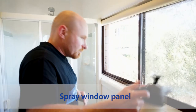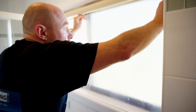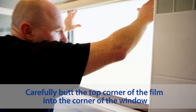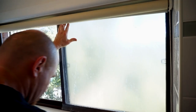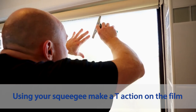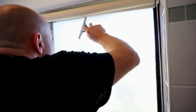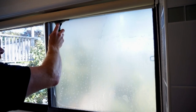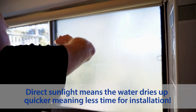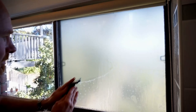You can always clean it up. Just transfer the film over carefully like this, running up the top edge and the right edge as well. If it doesn't look square you can always overlap both sides — that looks really good. Add a bit more water on there, get your squeegee, start at the top, and concentrate on getting the water out at an angle. Make sure the window has no sun on it if you can help it, because it'll give you more time to get all the water and bubbles out without the sun drying it out.